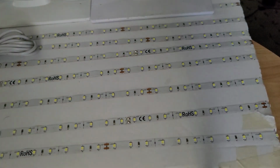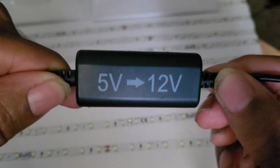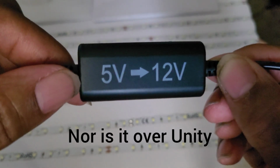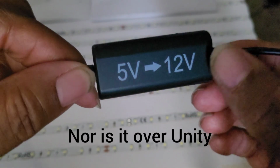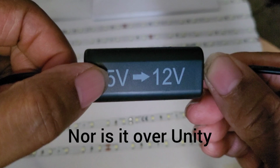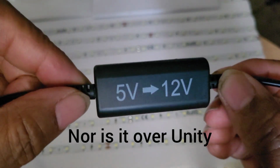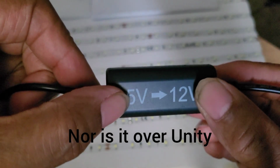Okay? And we want to talk about, is this pass-through charging? No, this is not pass-through charging. Yes, is there more voltage on the output than the voltage coming in? But that's not how they're saying it, and they don't realize that they're trying to say that more power is coming out than they ever put in.